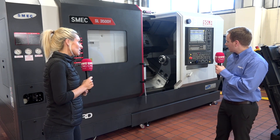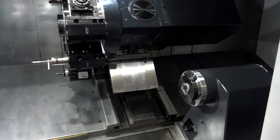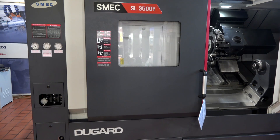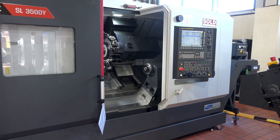All axes are built with box guideways, so when you're machining quite heavy parts or taking heavy cuts, that really helps with rigidity. The machine is quite long — on this model it'll machine 795mm, and on the XL model you've got 2095mm.